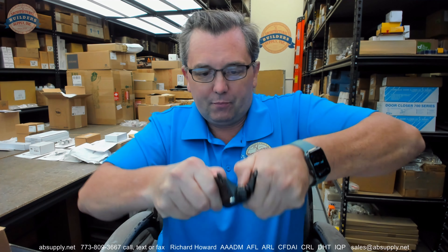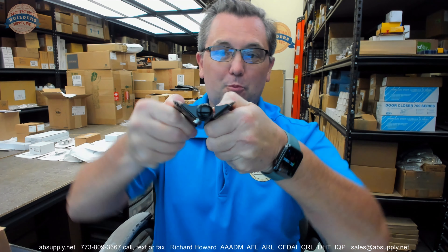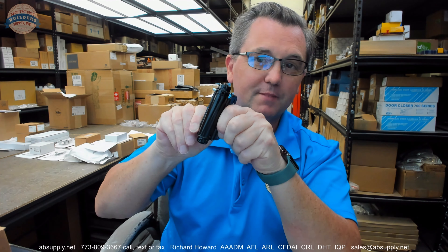The R2100 means that the spring is set in reverse, meaning that when the leaf — if that's the normal leaf — the spring action is going to want to open the door. There are reverse spring hinges. That means when you close the door, the door is closed, but as soon as you open and unlatch it, the spring hinge makes it stay open. You'll see that very commonly in office applications where they want the doors open all the time and only close them temporarily. The spring will keep the door in the open position otherwise.